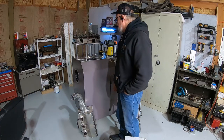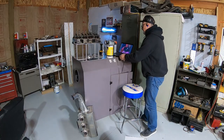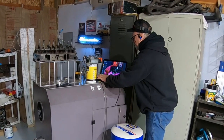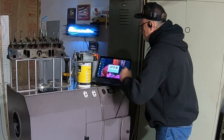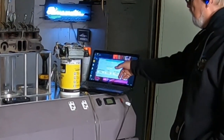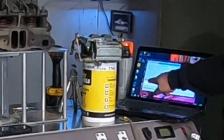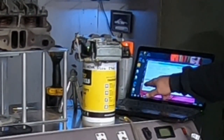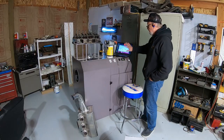Bruce, who's the owner, is an awesome guy. He also has the electronic flow equipment — let me turn that on — so that I can set my depression to whatever I want: 10, 20, 28 inches, whatever. It sets the depression and shows you how much CFM you're flowing, as you saw in the other video.